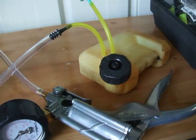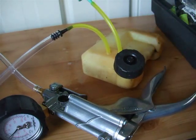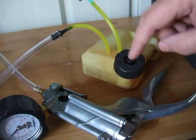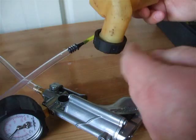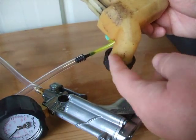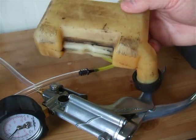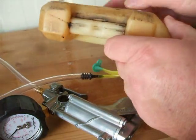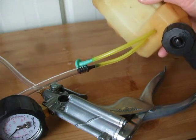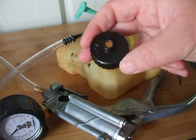If the cap hadn't leaked and the old cap hadn't leaked through the vent but was still losing pressure, and you'd checked the pipes, the next check would be to turn the tank or machine upside down and spray water around the tank neck - it could be leaking through the threads. And if it was still losing pressure after that, the next thing would be to chuck it into a tub of soapy water and see if the seams are leaking. Sometimes they leak so badly it takes two people - one pumping and one watching. Without a pressure test, you just wouldn't know.